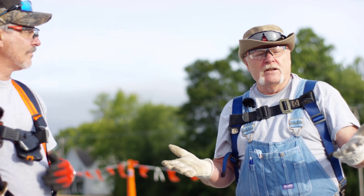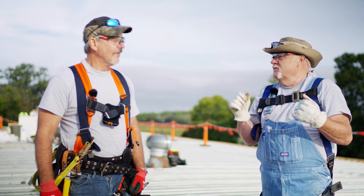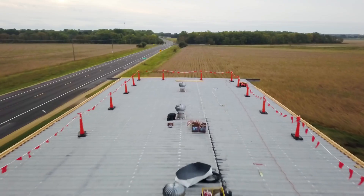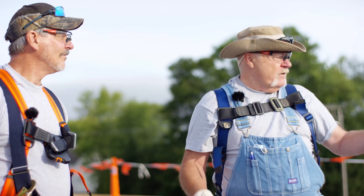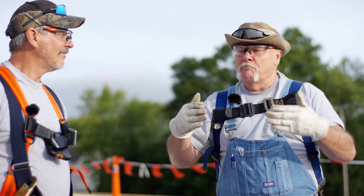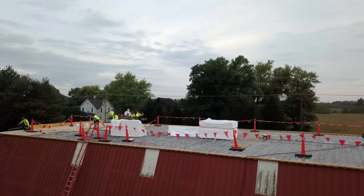There may be some contractors out there who have never done this and are just a little intimidated — or queasy, as you might say. But basically it's just like another roof. You have attachment points which are in the purlins, you have a fastener for the purlins, and you have your wood blocking and your flashings. So don't be intimidated. It's the same basic principle as a regular mechanical. The only thing you really have to concentrate on is getting your wood work out, because you've got to have something to nail or screw the metal to.